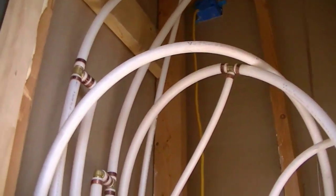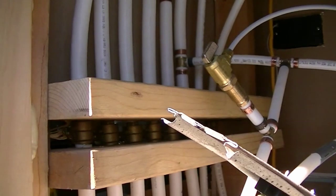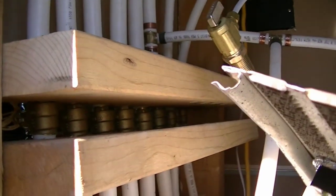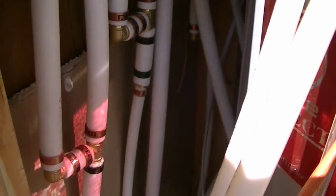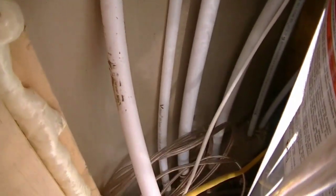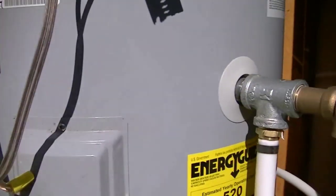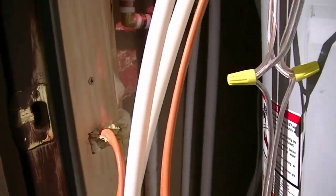All the piping goes to various places to help heat the water. Some pipe winds up through the roof and some goes down through the floors. You can see the valve array — we can turn valves on and off to direct the water flow as needed. The pipes that go down through the floor go across to a heating coil in the fireplace. Where the pop-off valve is, there's a T fitting that serves as the return from either the roof or the fireplace, depending on where we're getting the heat from.